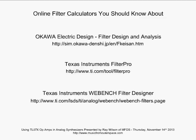Some people interpret capacitor markings that the straight line is a positive pole and the curved line is the negative pole. Some people draw non-polarized capacitors that way too. If you look around, you'll find that. Whenever I have a capacitor and I want it to be polarized, I put a plus by the straight side. If there's no plus, it's not polarized. So even though you might have seen a symbol before that looked like a polarized capacitor, in this case, it's not. You don't have polarized capacitors on your inputs. And on the outputs, I'm using bipolar capacitors, which are also aluminum electrolytic technology, but they're not polarized.